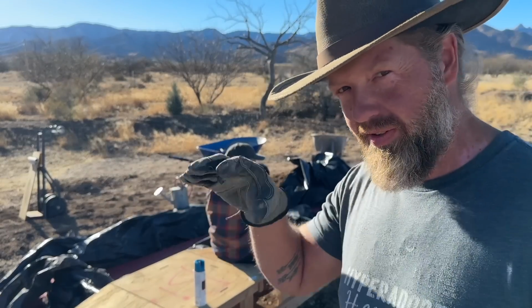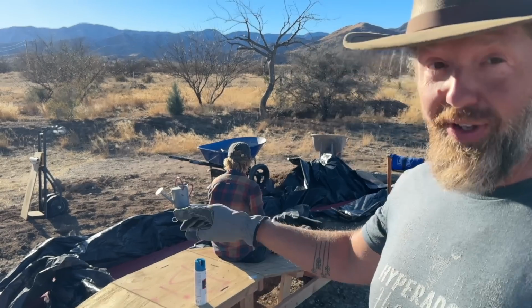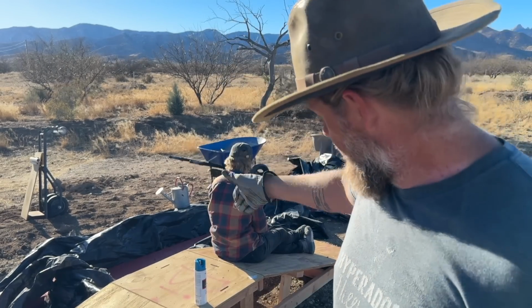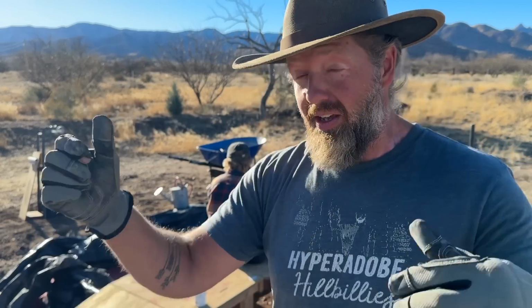All right, so we've dug out, we've built up with gravel, put in hardware cloth and vapor barrier. We laid one bag up to the level of the existing bag, and then we're going to do one more bag that goes from where it crosses here all the way to the end as a single unbroken bag. We should be done for the day.